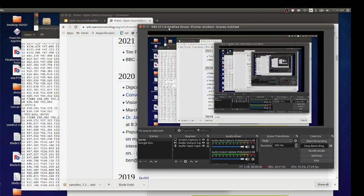How do we put that on a microcontroller and say, move the cylinder here, move it there, with a little bit of feedback? In the current system, we've got a pressure switch, a pressure sensor, connected into the hydraulics. You screw that into the hydraulic lines on the high pressure side and observe: when the cylinder bottoms out, it gets all the pressure because it can't go any further, so the pressure switch triggers. That's an example of a very simple on-off device, just like the thermistors, which actually read you the temperature through the code so you can have feedback. But in the brick press, all we have is a pressure sensor.